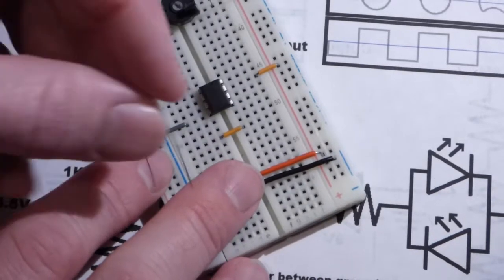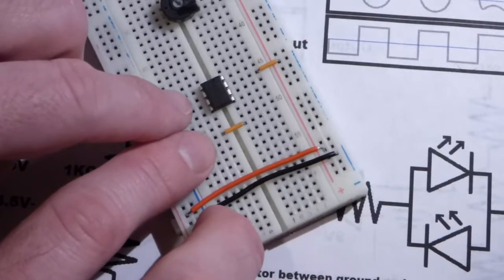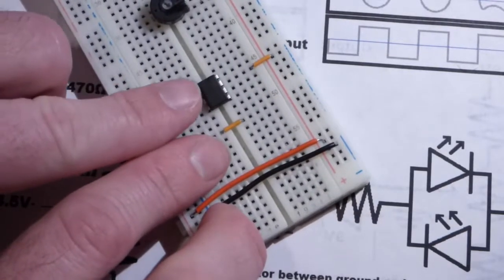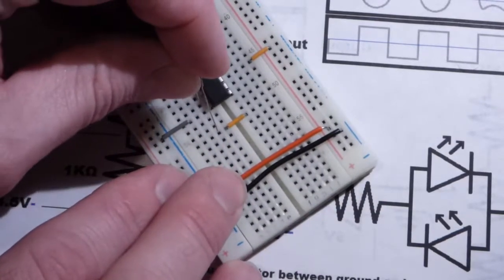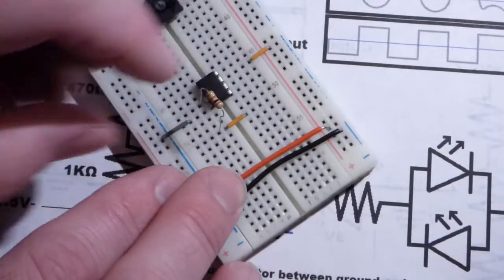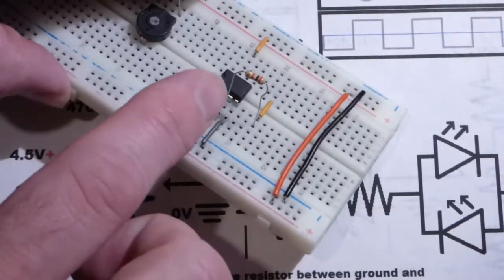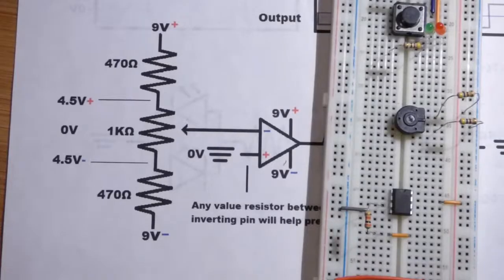I'm going to take a 2 kilo ohm resistor. The value of resistor doesn't matter. We could even just attach a wire directly to it, because ideally the op amp doesn't allow any current through its input pins. But I like having the resistor in case I short circuit to something next to it or something. We have this resistance to limit current flowing somewhere else.